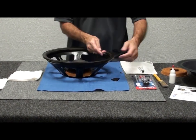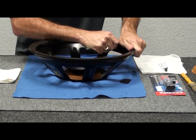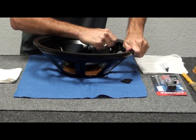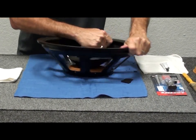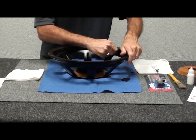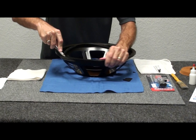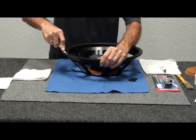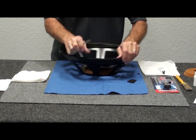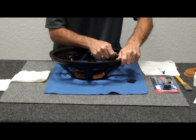Next, I'll come in and remove the gasket by just working underneath it with the blade — slow and careful all the way around. A couple of times you'll see how it starts to free up once you get through it. Just keep at it; it might take a few passes to get around it. I like to do a little vertical cut with the blade as well to help break any glue in the corner of the frame from the gasket.